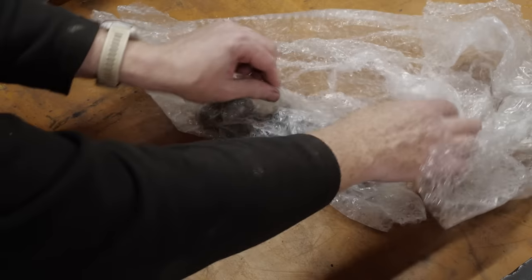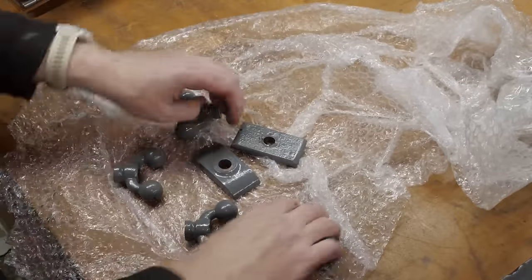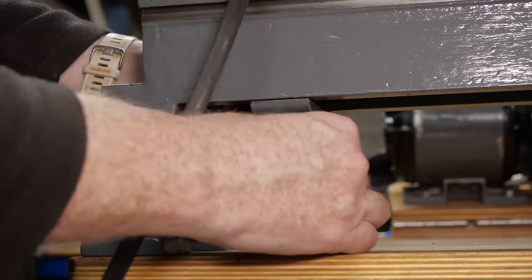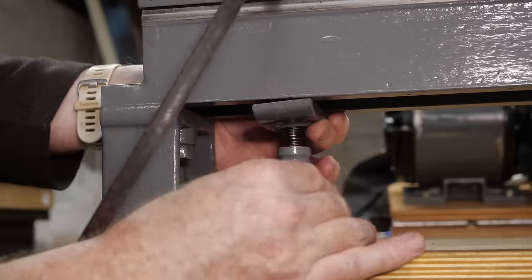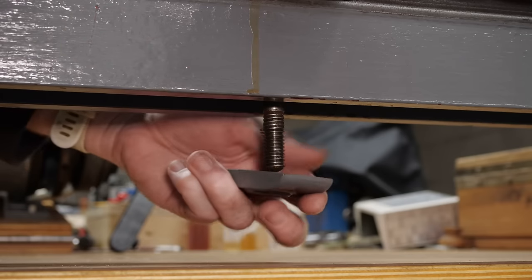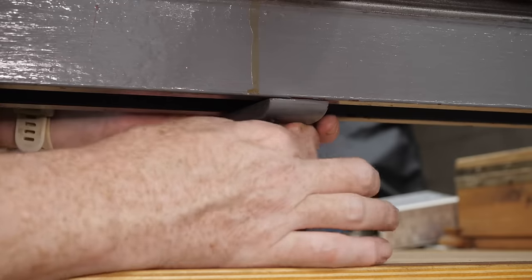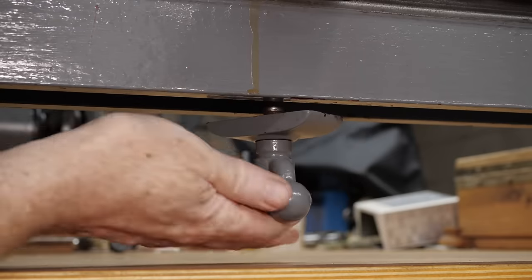The final bundle contains the clamps and hand screws used to fix all three parts down onto the bed and hold them in position. The clamp plates sit on the flat underside of the bed, and allow a nut to hold each part firmly down. Unlike an engine lathe where the carriage can move freely during turning operations, the cross slide on this lathe is fixed in place. This does mean the lathe is limited in what it can do, but it gains in rigidity and simplicity.